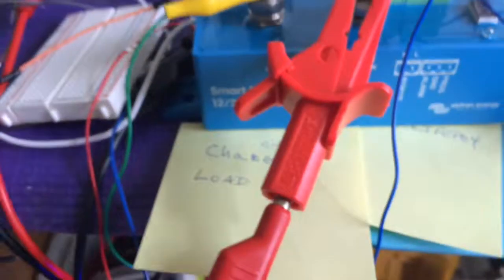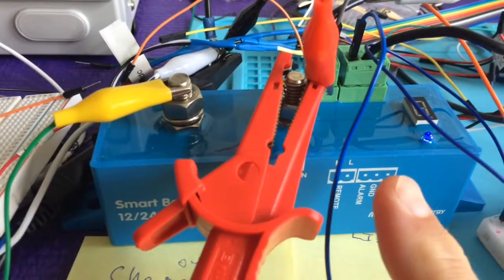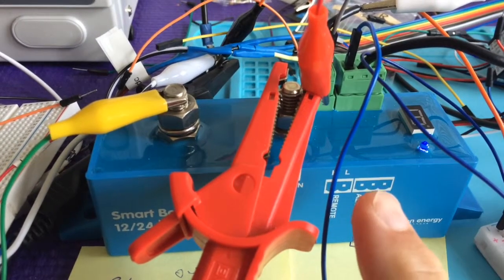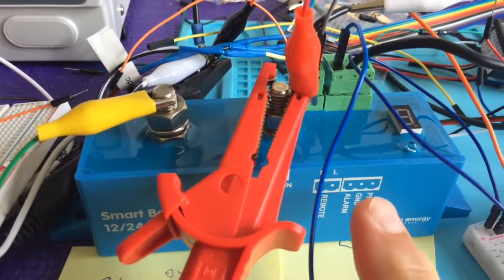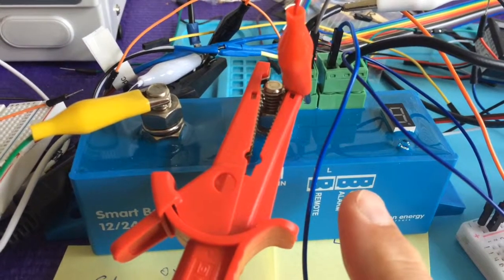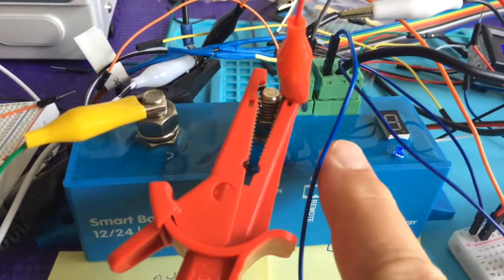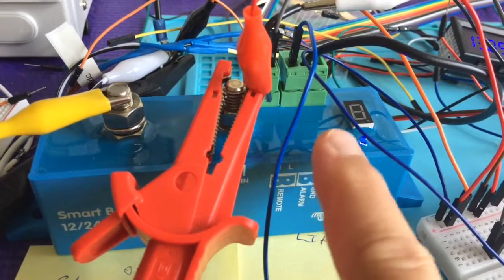And again, I have a battery management system I showed you before. But the MOSFETs are particularly useful in creating these high voltage and low voltage disconnects that we use at the pack level. Now remember, my pack strung together is running about 13.2 volts right now, but the individual cells are running at something like 3.3. But this allows us to make some very good decisions in cutting off our batteries before we deplete them.